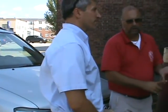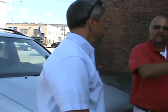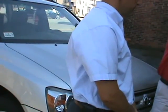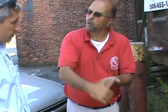But if you have a permit that you pull, and you are the one overseeing that to make sure the vendor who's doing the work is correct, then there's the final test, which is just the sign-off. Meaning, if I'm going to oversee this job, the engineer has to oversee. So there's 3 to 5 visits required by an engineer. If he's going to be signing, he can't do an initial inspection and a final inspection 6 months from now. He must schedule, and get paid by the owner, an initial inspection review as the vendor's starting to do the work. He must show up when the vendor's working, watch the job, make sure it's going according to his standard, come in the middle of the job, come in at three-quarters of the job, and then do a final, because he's signing off on a certification.